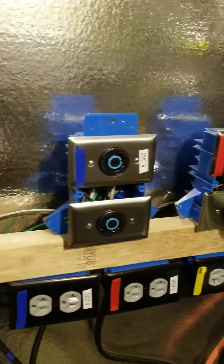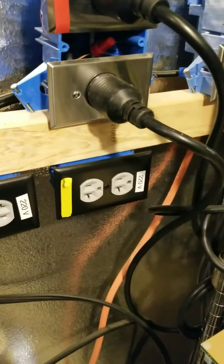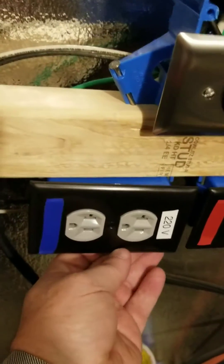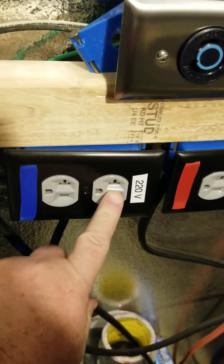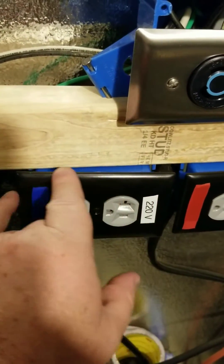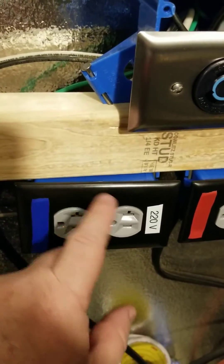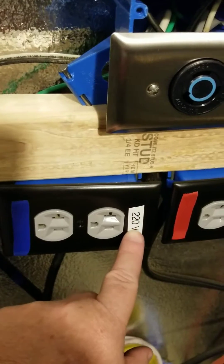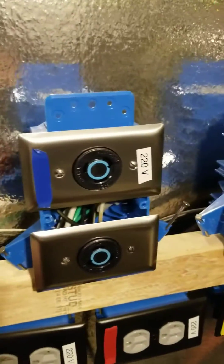You can see that I'm already wired in for my next few machines that are coming in. I did some 110 outlets and turned them into 220s, but I made sure I got 20 amp so they can handle it. I also got an off-color — you can see they're gray instead of tan or white — and then I got a black cover and labeled them 220 just to be safe. The colors correspond to different breakers in my breaker box so I can identify them quickly.